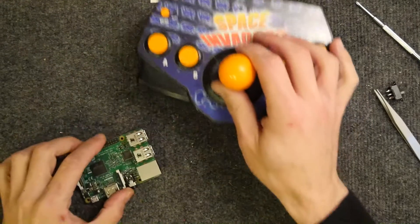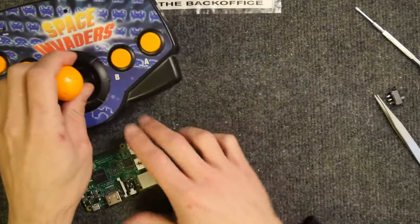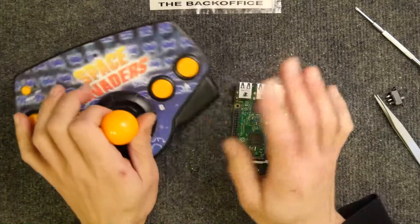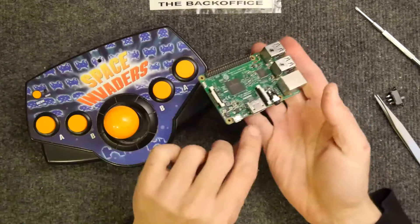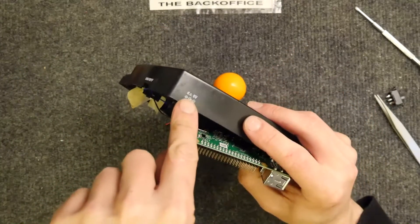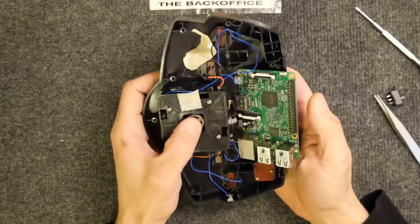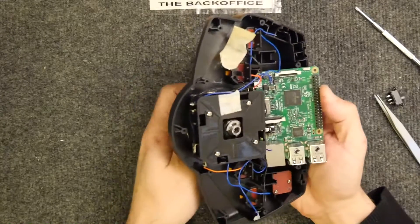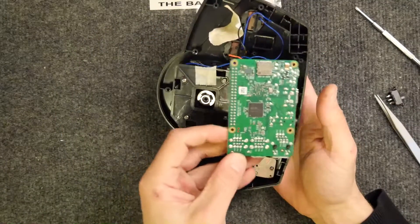Especially if you can get a lithium cell and a battery — those battery supplies you can plug into your phone, called power banks. Power banks make great power supplies for projects because you can plug this into your Raspberry Pi via its connector, mount that in there, and on the port here put the wire that goes to your power bank charging port. Your power bank contains all its own internal circuitry for charging and keeping it alive, giving you a quite nice power supply without having to worry about battery controllers.